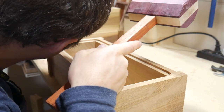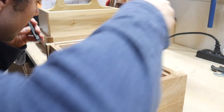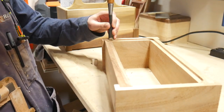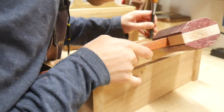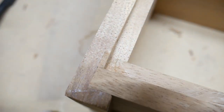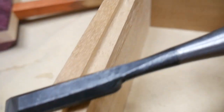Using a router upright will leave you with rounded corners, so I come in and clean them up to sharp corners — it kind of shows the craftsmanship. You have to be careful because if you take too heavy a chop you'll sometimes split the joint between the side and the end and the dado, so keep paring the material until you're within about a millimeter and then go to your shoulder line. If you follow that process and practice your chopping with a chisel, you'll get perfect square results every time, and I really liked how they turned out.